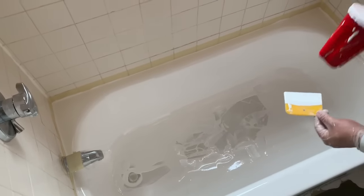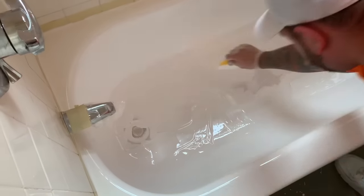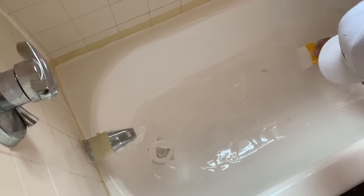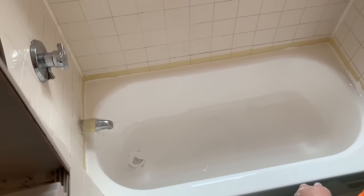It's best to try to get a little bit more material towards the center versus the outsides, because it's going to keep running down and if you don't have enough material in the middle you'll be left with a couple of little waves on the edges. So what I like to do is level everything out and move a bunch of material towards the center of the tub. Then after we comb through everything, give it a quick pass with the blow dryer just to pop any extra little bubbles. That's where I like to start pulling any drips towards the middle. We're just moving the material around and making sure everything is covered so there's no spots that the material can't flow into. It looks like a disaster on the bottom right now but once the leveling goes through it, that's going to make a whole change and it will be noticeably different.